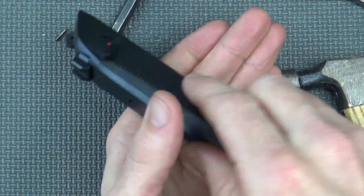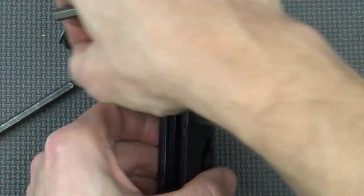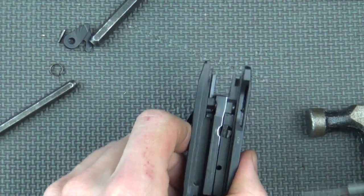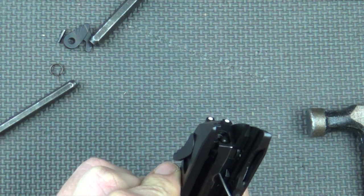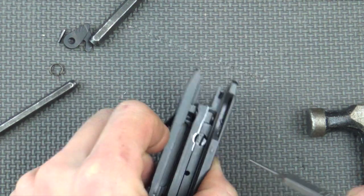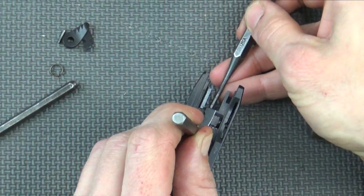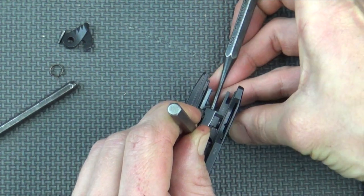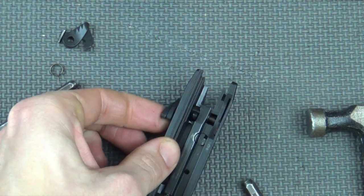To remove this side of the safety lever, first take the spring off so we don't lose it. It's kind of a two-part process: we're going to push both on the firing pin safety and then on this little ball exposed on the back of the hammer. Depress the firing pin safety, then depress that piece in the back, push forward — you hear that click, that's what you want — then rotate up.